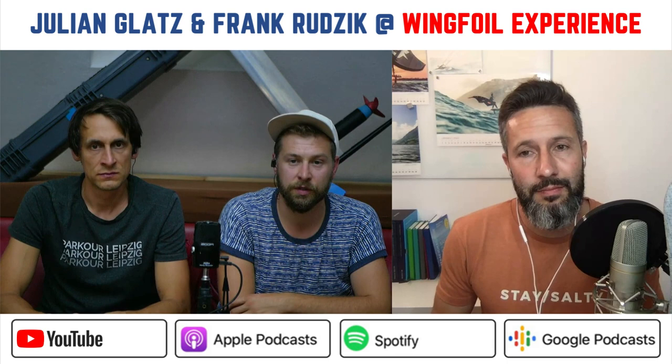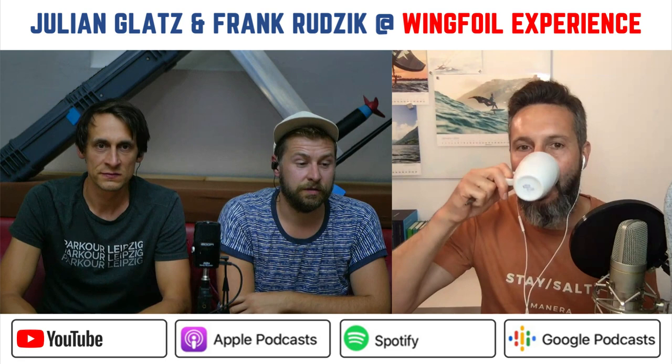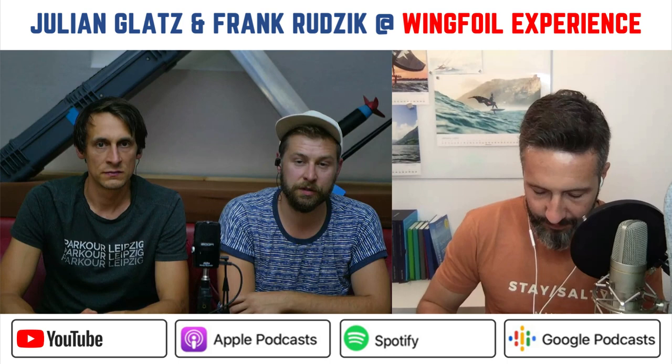There's already a company in Australia called Foildrive — foildrive.com — doing exactly this. They're selling a strap-on system with a battery that you can put on top of your normal surf foil or wing foil board and attach a motor. It's not very powerful because they use it mainly to catch waves. They also have a really good idea with a folding propeller instead of a fixed one — the blades automatically fold when the motor is off, so you have low water resistance when surfing a wave without power. You can turn it off and just surf the wave.